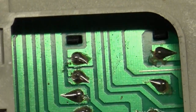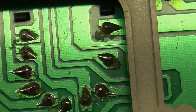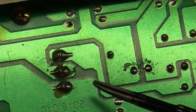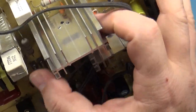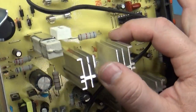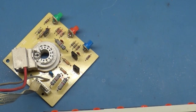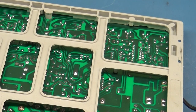Who knows if they got this in the wave machine just right. The flyback seems okay, though it's odd to have the teardrop solder going on — it should just be a nice round joint. The yoke header pins seem to be soldered in okay. So let's reflow that heat sink — that heat sink is for our vertical IC. This pin here is loose; I can move it around. The other side is okay, but this side is actually cracked, so we're going to reflow this one.